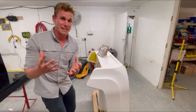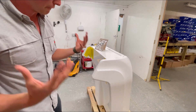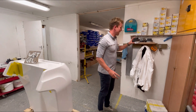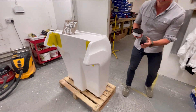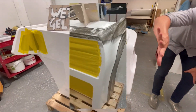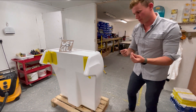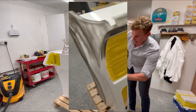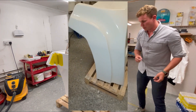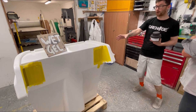Eventually you won't actually be able to see that there was any sort of damage or harsh edges when it came out of the molding - and that's how you get a really advanced shape and the finished Ribeye product. The first thing Jay would do here is grab this guide coat, which is like a charcoal powder. When applied all over the surfaces, the powder finds its way into all the nooks and crannies. When Jay or a member of the team starts to sand that back, you go finer and finer with the sandpaper up to 1200 grit, and eventually it becomes flat because the guide coat won't be visible. There's then a two-part polish applied which gets rid of any pinholes in the surface - you'll always have a few imperfections out of the actual mold surface from the tooling.